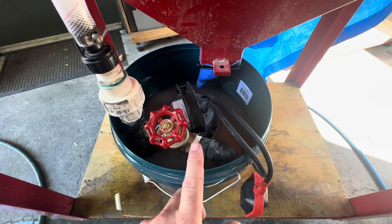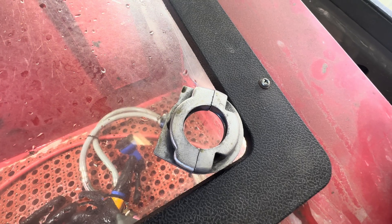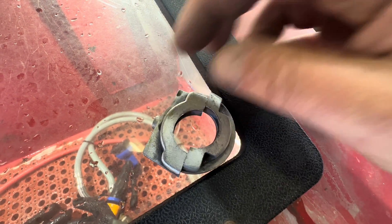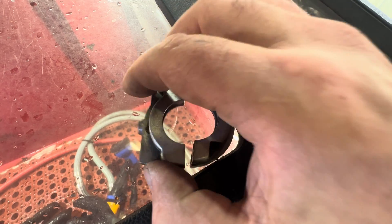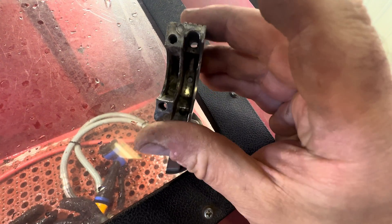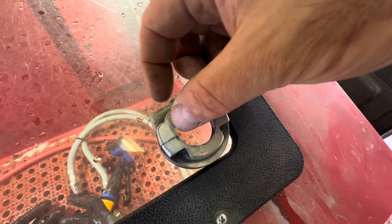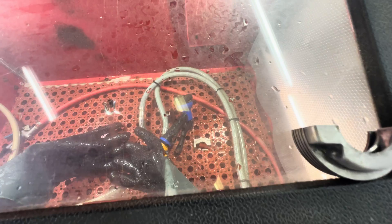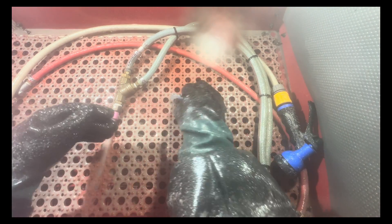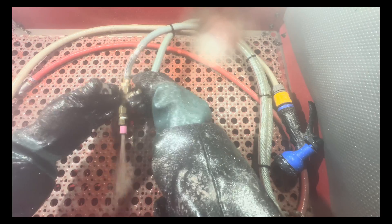I just fill the bucket up two-thirds to three-quarters of the way up. I don't worry about putting the pump on a plinth to raise it up - I haven't found that's necessary. Just switch the pump on and let it do its thing. I've got a throttle assembly to give a quick clean to and see how it comes up. I generally aim to degrease 99% of the parts as best I can - this had a whole lot of graphite in it from the throttle tube assembly, so I've cleaned it out with carby cleaner. I didn't turn the camera on for the first pass, but it's come up much better. I've dropped the pressure down to about 30 psi to get a better shine from the glass bead - higher pressure for cleaning and lower pressure for a better surface finish.